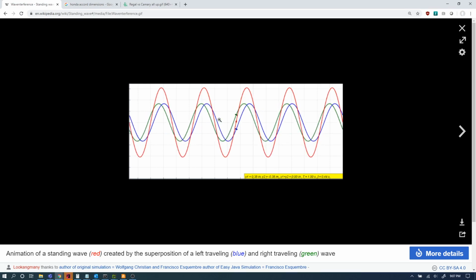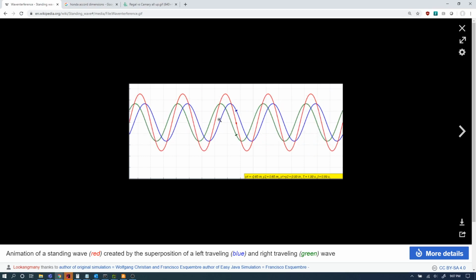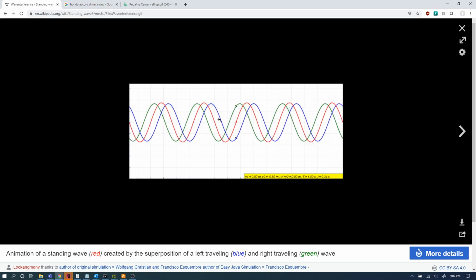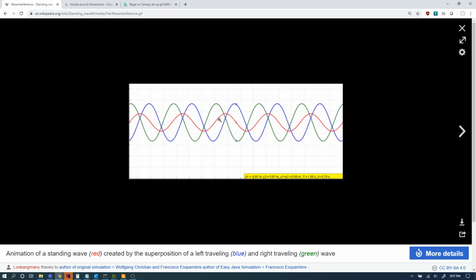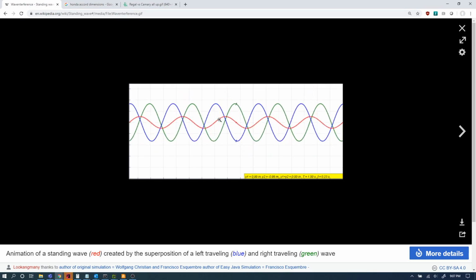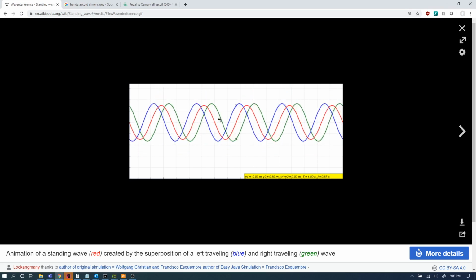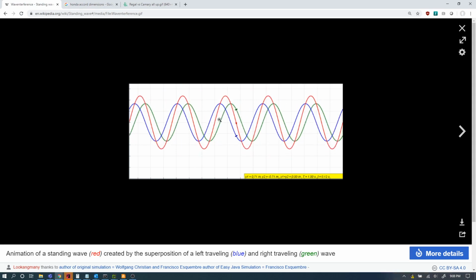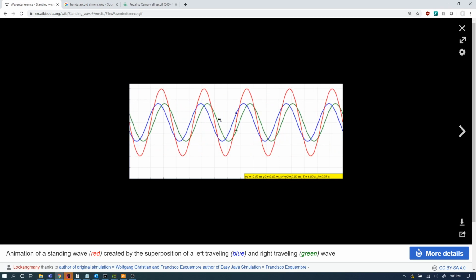So first off, here's an example of the superposition of waves. Basically, what this means is that if you have two series of waves, there are going to be frequencies where those waves are in phase, and frequencies where the waves are out of phase. When the waves are in phase, if they are receiving equal power, they're going to become 6 dB louder. And when they're 100% out of phase, they're going to be at 0 decibels.